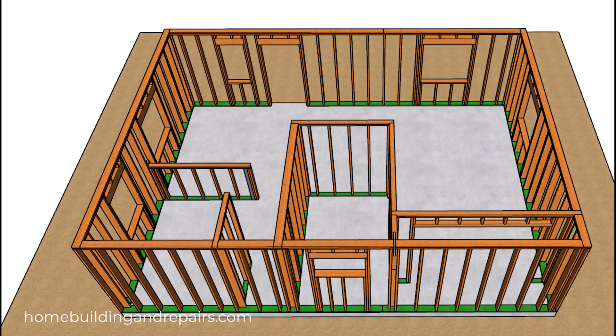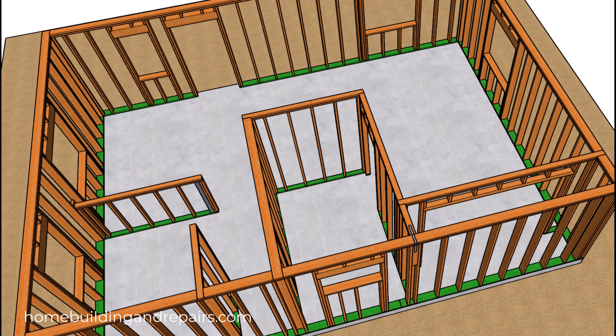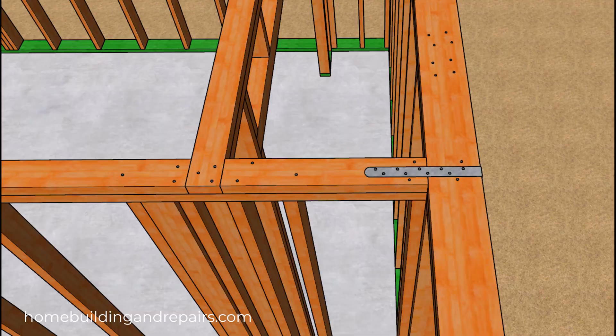In this video I will be going over the top framing plate breaks and nailing patterns. I want to go around the top plates to give you an idea of how I would nail all of this stuff together. These are 16D nails, and we have a strap here that I'll go over in a little bit.